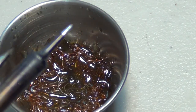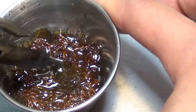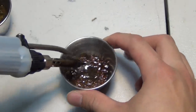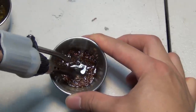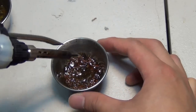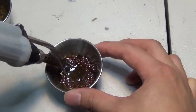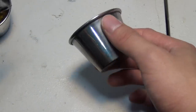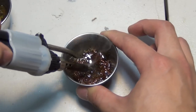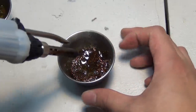I can turn off the suction — notice this doesn't make all that much smoke. With the suction off, you don't actually make that much smoke from this tinning device, and it's completely safe. There's no harmful material in this. It's really just copper, rosin flux, and tin alloy that's low melting. Outside, the cup is made of standard steel. Standard steel doesn't soak out solder, so the solder won't adhere to the container itself.